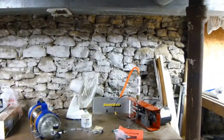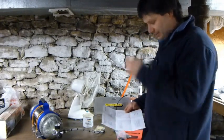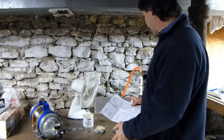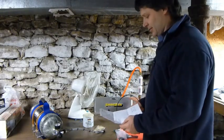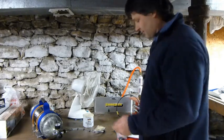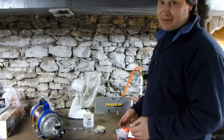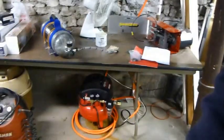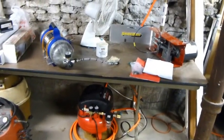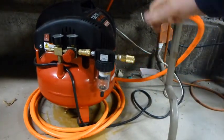If anybody's done any research on the shoebox, you can go to their site and find out you need a little shop compressor to feed the high pressure compressor. My basic setup is I got the mini shop compressor down below, and then I got a coil of hose. Basically, there's the little shop compressor and there's roughly 25 feet of hose here, wound up.